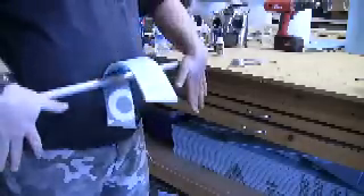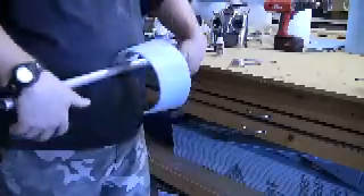The reason I like to use the aluminum is because I don't risk getting a concave part as I'm doing the rolling, because the aluminum doesn't bend the same way PVC does. I take the part with the printed side facing outward, I place the aluminum tube like so, and I roll. Depending on how tight you need the roll you can use different diameters of tubing — you can roll harder or softer. Once you do a couple of these you'll get a feel for it; it's pretty intuitive.